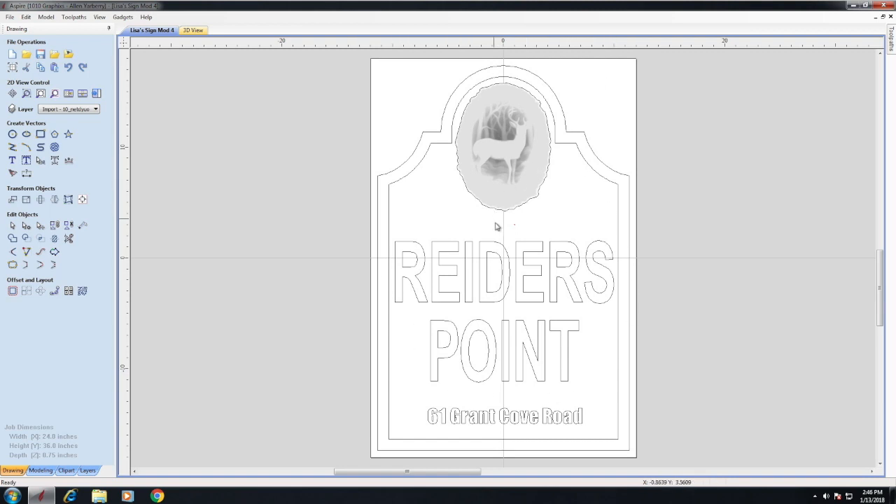This is the sign. When you start looking at it, you'll see something unique: up here there's a grayscale image — that is for the 3D carving. Down here with these letters, this is for the V carving. There's a big difference: in V carving, the bit rides in between these lines, and when using a V bit it gives you a very sharp, crisp edge along the side.